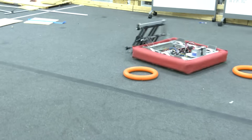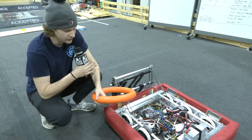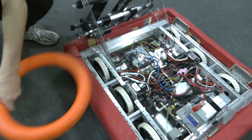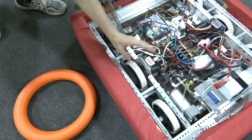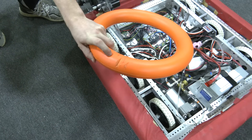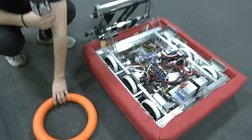So it is possible to get loose, but it's just something to be aware of. When we were doing that test, we actually did have a little bit of damage on one of these notes. You can look closely and see that damage, which matched pretty much perfectly up with our pulleys right here. So likely when we got stuck, somehow this got interference with the pulleys, or it could have been somewhere else on the robot. Either way, we ended up with some damage. But we got the bumpers raised up to two inches and we're going to go ahead and do some tests with that now.